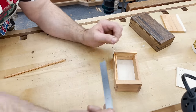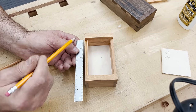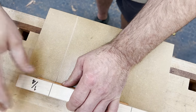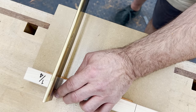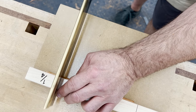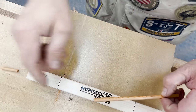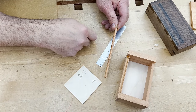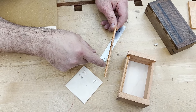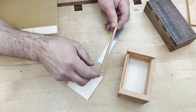So on something this size, I think I'll do a 5-piece. That'll give me 3 pieces on the bottom, 2 on the top. Now I'm using my little, my small joinery crosscut saw, which simply means it's only going to consume 24/1000ths of an inch. The reason that's important, when I put these pieces all back together, I want as little interruption as possible on that joint line. If I used a table saw and was taking out 1/8 of an inch, then it would be more noticeable. But this, I can pretty much get by with having it completely hidden.